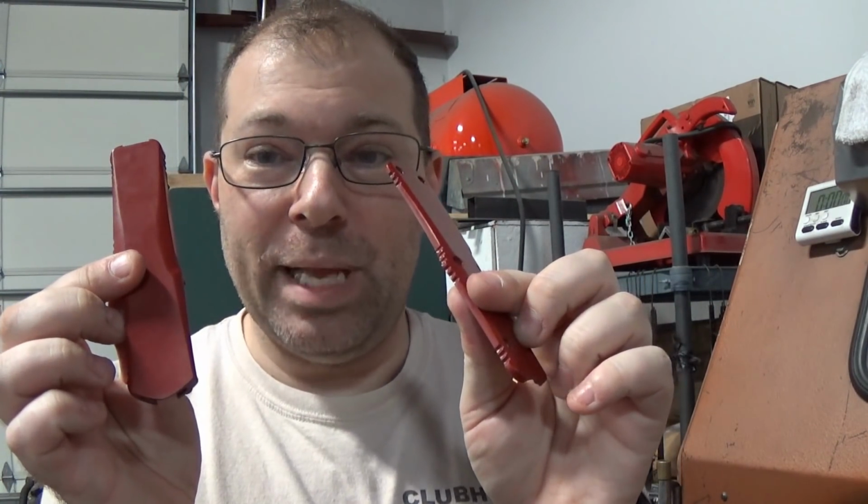Fun part, I get to sandblast this. I like sandblasting. It's a new skill. It's fun. So we're working at 125 grit garnet at 80 psi. I know it's going to be kind of hard to see through this window. Here's the piece. And we're going to make this red go away. Pretty cool. This is the only real good way to get rid of Cerakote. This is also how you make all your bead blasted blades and stuff like that.